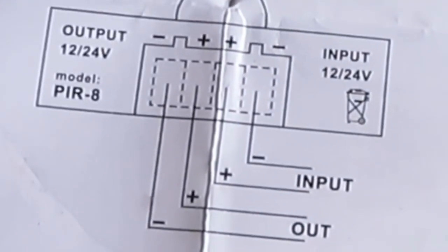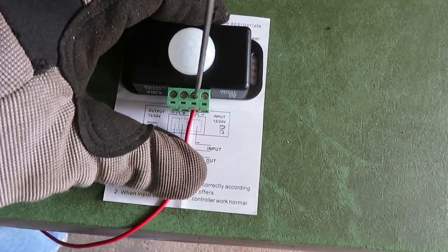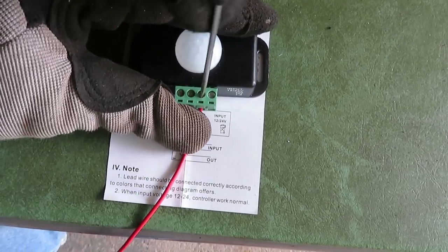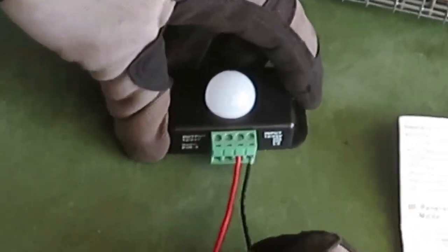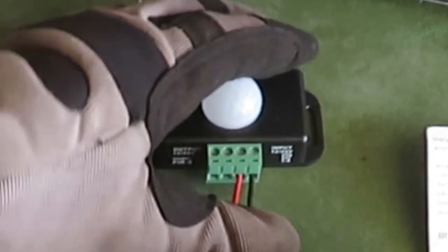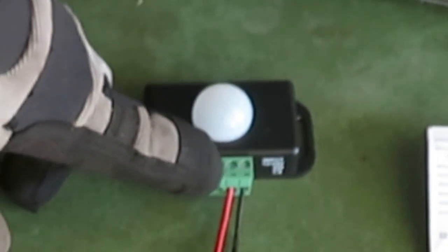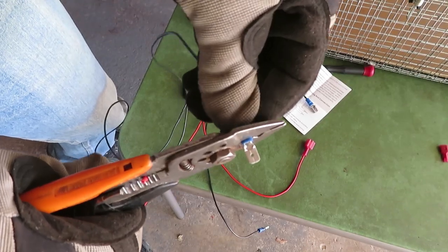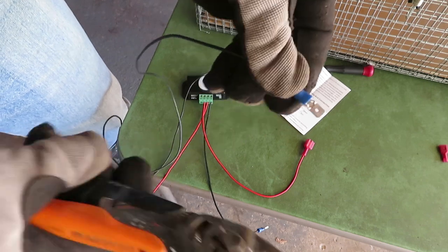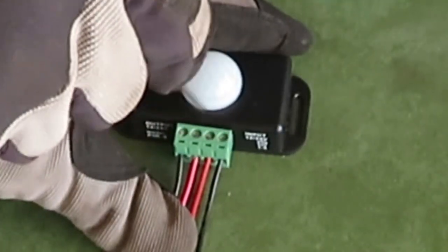Here's the wiring diagram — pretty simple. On the right are the battery inputs. I'm putting in the positive right now, going to the positive terminal on the battery. The black wire is the negative terminal, battery minus. The positive end we're going to put on the switch — plus 12 volts output. I'll put a crimped male spade on this end, the other end will be female. And here's the minus 12 to complete the circuit — that's going to come from the solenoid.